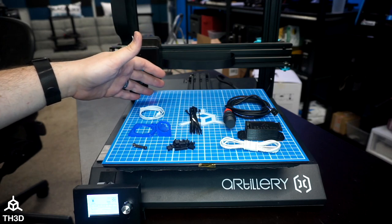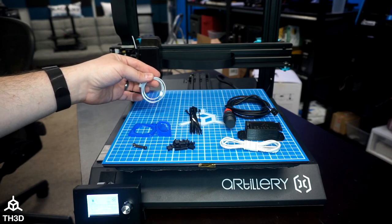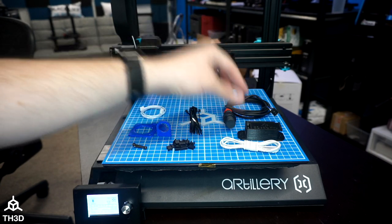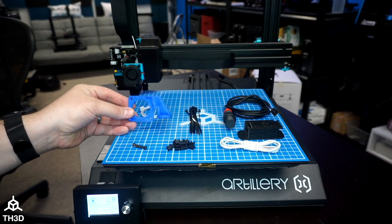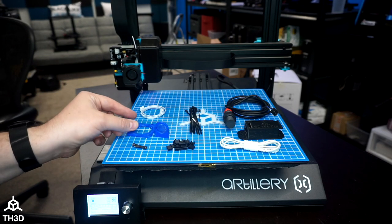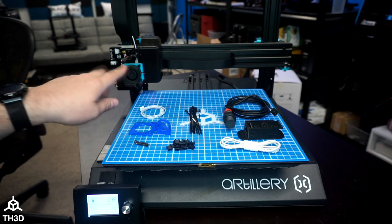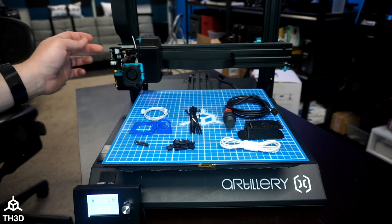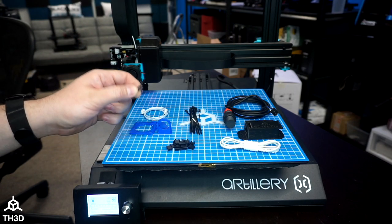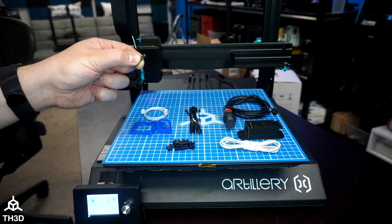From left to right, we're going to go over all these parts. This right here is our X1 Z end-stop signal cable, and this connects from the printer's control board into the 3-pin connector on our EZ-ABL Pro board. This is the Sidewinder X1 OEM mount, which allows us to mount the sensor to the right of the blower fan. You'll need two longer M3 screws — M3 by 20 millimeters. Some X1s may have screws that are long enough, but I'd recommend checking yours. If you don't have two M3 by 20s, you can pick up the screw assortment we carry or source them from your parts bin.